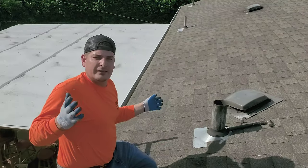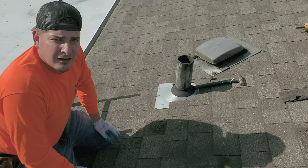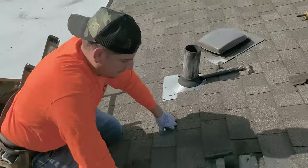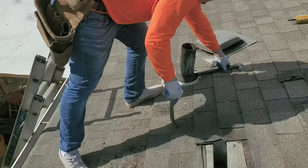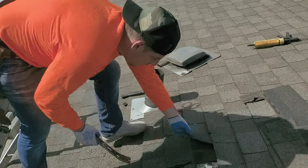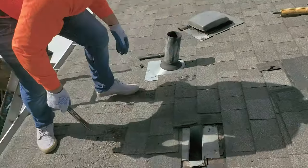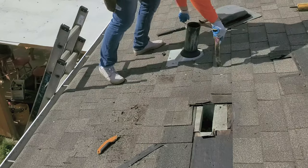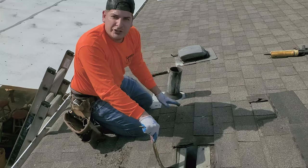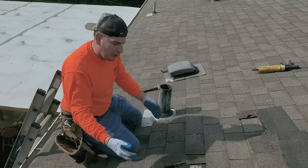Is this stuff leaking inside of the right around the vent? Water drains down the vent and it leaks on this side of the sheet rock underneath. So what we're going to do is keep on tearing in here and see if we can find the corner some more. Let's come back and take off a couple more shingles. What you don't want to do is just start ripping into it — we're going to take off a couple more shingles and open it up.